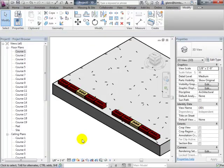I put them in every 8 inches, because if I had the 7 5/8 inch and I wanted to allow a little space for the mortar, that gave me that little bit of gap. So go ahead and try and get yourself set up with one row of what you like. And as soon as you have one row, we'll go ahead and copy it up and make another row and make another row. And hopefully you'll be looking pretty good.